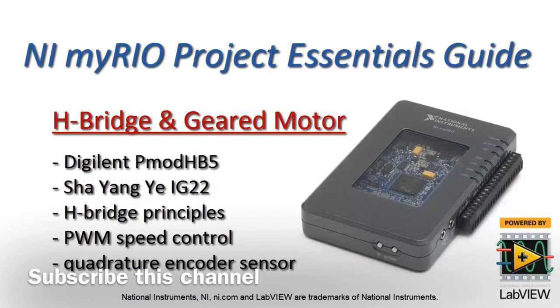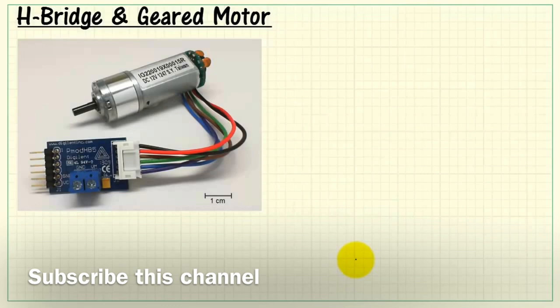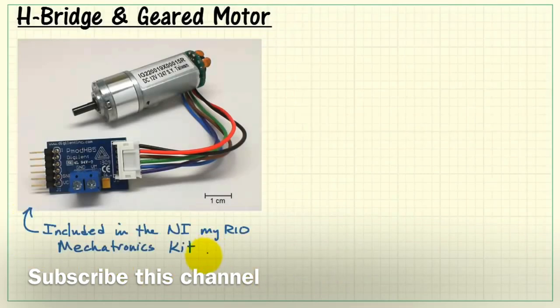Now I'd like to introduce you to the H-bridge and geared motor. We'll be looking at H-bridge principles, pulse width modulated speed control, and then the quadrature encoder sensor that serves as feedback for measuring speed and rate.